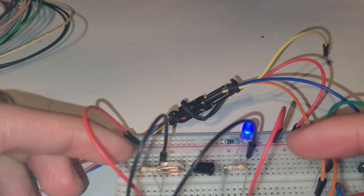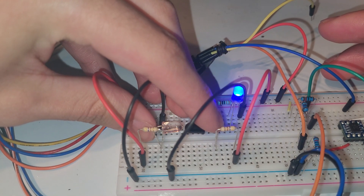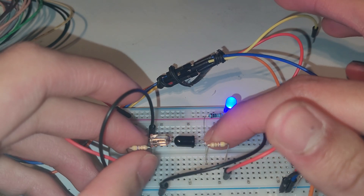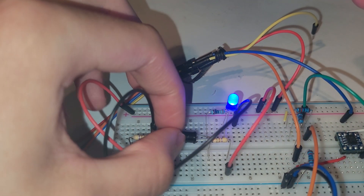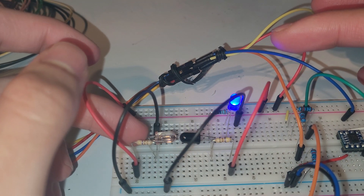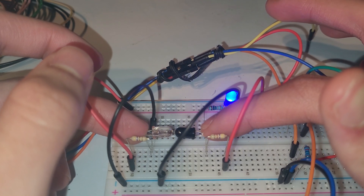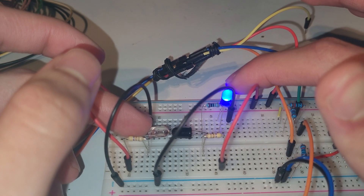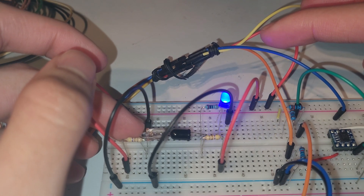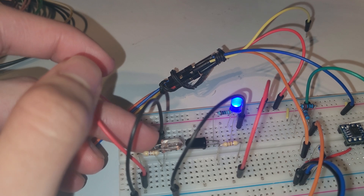Powering on the supplies, we can see the LED is lit up. It's not very bright because the infrared LED and phototransistor are separated. If we bring them together, more current flows because the phototransistor is detecting more infrared light — so pushing them closer makes it brighter, and farther apart makes it dimmer. This simulates how current through the infrared LED affects what the phototransistor picks up. Here we just have an LED, but we could have much more hooked up — this could be part of an integrated circuit. This is a fork from our previous project where we built optocoupler circuits.